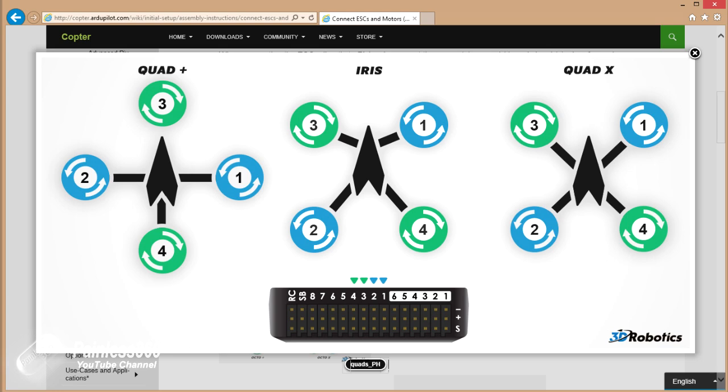So now we've got that done, the only last thing we need to think about before plugging this in is the power connections. We've talked briefly about it on the way to this part of the video. I would recommend, if you're going to power the PixHawk with the power module, don't put any of the red wires in. Just tease them out of the servo connectors, peel them back and secure them with a little bit of heat shrink so that they're not in the way.